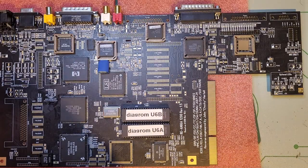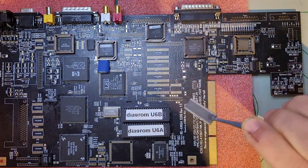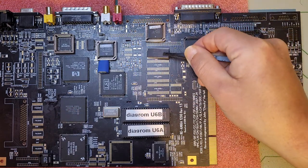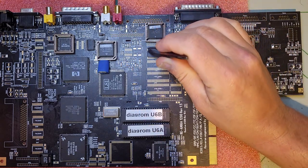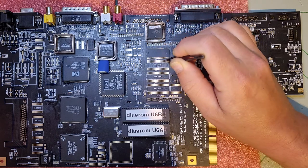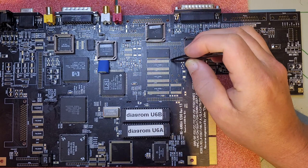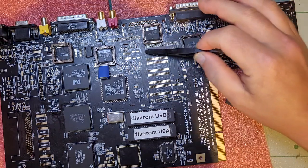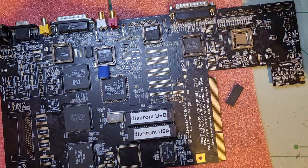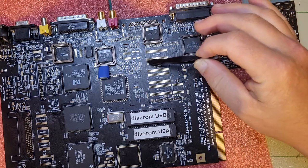These are going to be interesting to populate because they're SMD components, but those legs are like these guys, whatever they're called, I forget, and they're going to be a pain to solder. These are probably the hardest ones to solder in place, not just because they're PLCC, but because there's very little clearance on each side. The way Chucky recommends to do it is to tin those pads, which I was doing for these anyway, and then use a hot air station to just melt the solder, and then finishing touches with the iron.